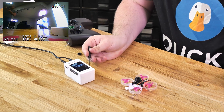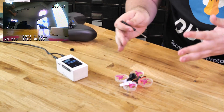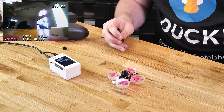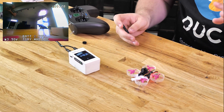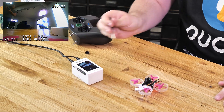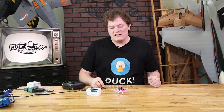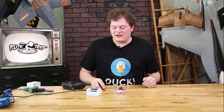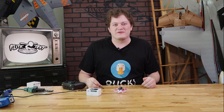In the bottom corner you'll see the battery voltage — it says 3.9 volts right now because this battery's not fully charged yet. Fully charged, the battery is going to be between 4.1 and 4.3 volts. You'll want to land once you start getting down to around 3.3 or 3.2 volts. There should also be a little pop-up that tells you low battery to let you know it's time to come back and land. Now everything's bound up, programmed, and ready to go — you're ready to go out and do some flying and have some adventures with your Ultra Micro Drone. We'll see you next time.